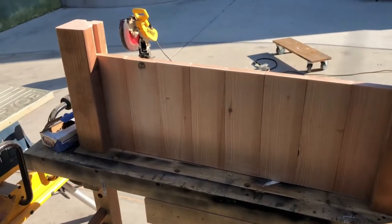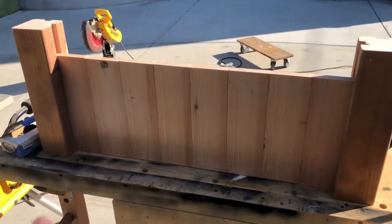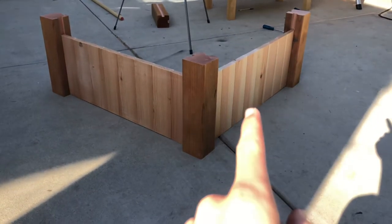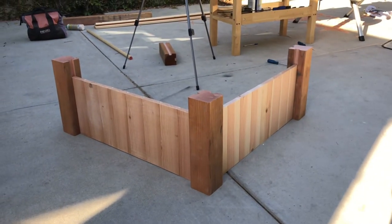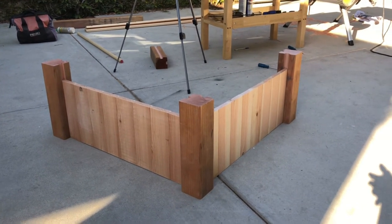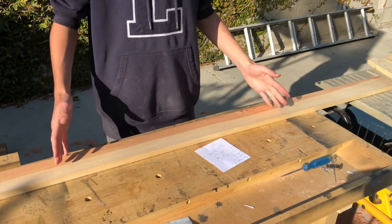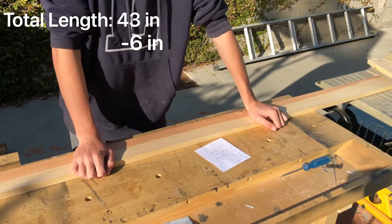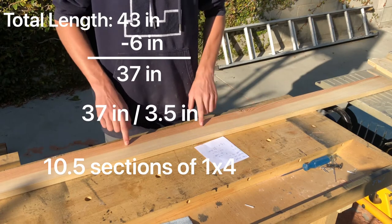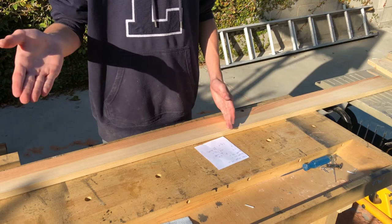Here's a quick look — this is what one of the sides looks like, and of course there'll be three more to make a complete square. This is kind of what the finished product is going to look like. So I got the other side done. For the longer side — it depends on your measurements — if you do the math: my total length is 43, subtract 6 for the 4x4 and indentation, that's 37 inches. I need about 10.5 of 1x3s for the length, each 11 inches long, similarly to the other ones I just made.